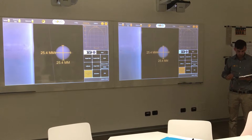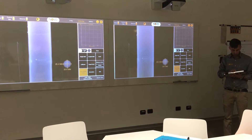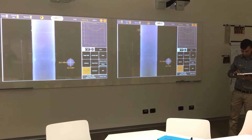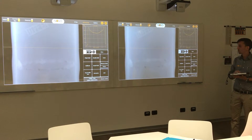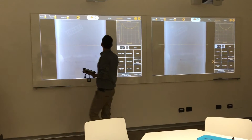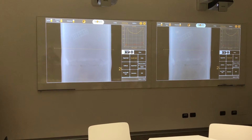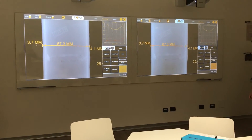I can close the calibration and now I can go and do the actual measurement. So we stretch this line on the pipe — we don't have to zoom in or place the line accurately on the pipe. The software will automatically detect the edges, meaning the beginning and the end of each wall, and with just a single click, it is able to give us the measurement.